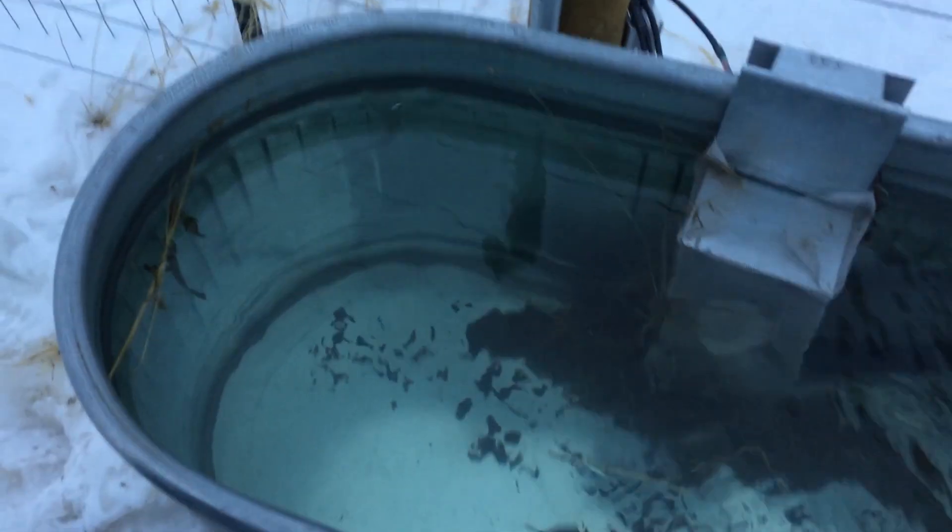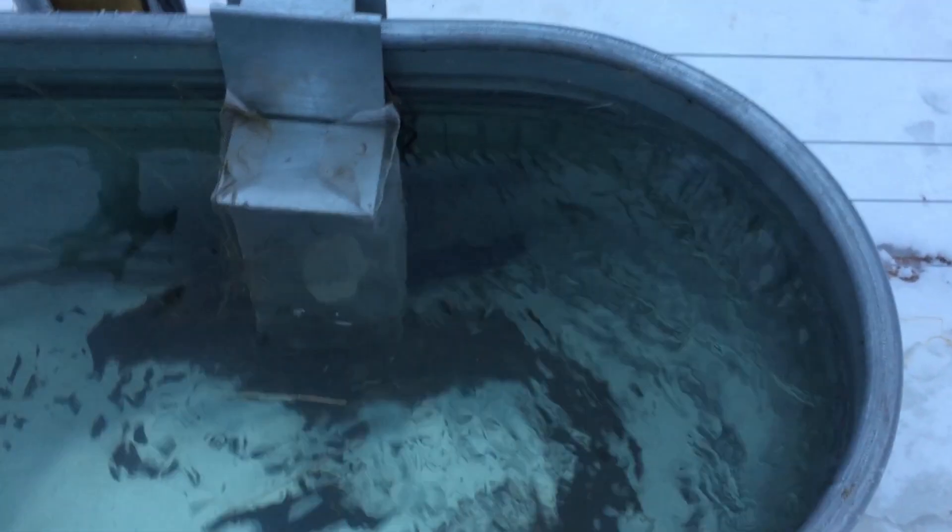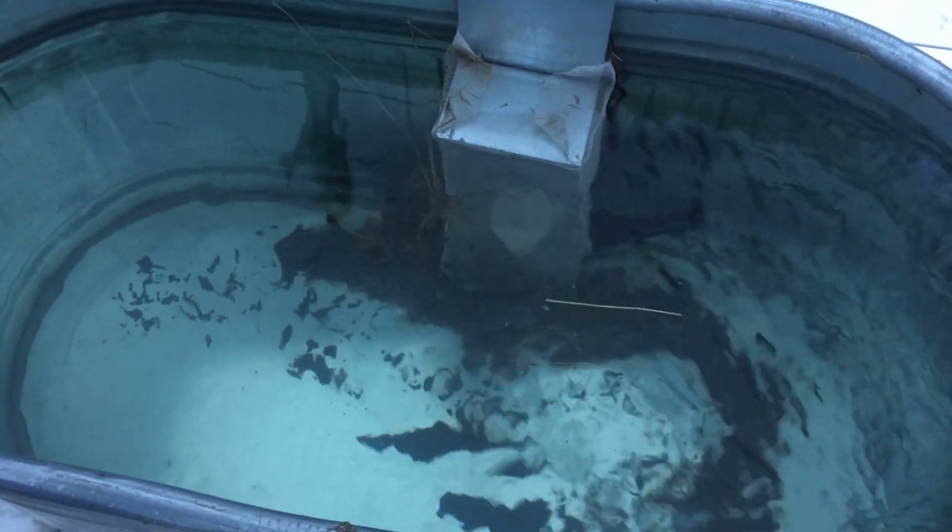Hopefully it keeps the pump clean and allows the pump to breathe enough to get enough water in and keep the water moving. It's the next morning and that screen seems to be doing really well — the water looks all clear. All the particles are down at the bottom swirling around, and we've got our surface disruption keeping the water from freezing. My lips are frozen — I can't talk — but it was about 20 degrees this morning. In all theoretical knowledge this should be frozen, but it's not, so it's doing its job. Success! We've got one other unit ready for next year when we have more cows.